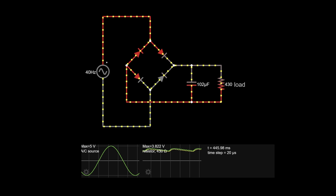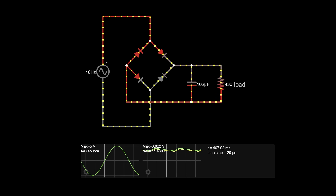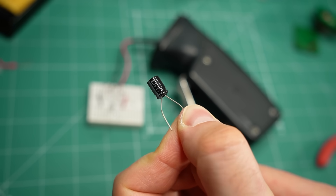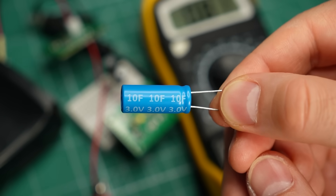Another issue is that the mechanism in the flashlight makes alternating current, or AC. However, a capacitor will store energy only in a DC circuit, so we need to convert AC to DC. The solution is to use a full-wave bridge rectifier. But this brings along another problem: supercapacitors have a very low voltage rating. For example, this one goes only up to 2.7V and this one is rated for 3V maximum.